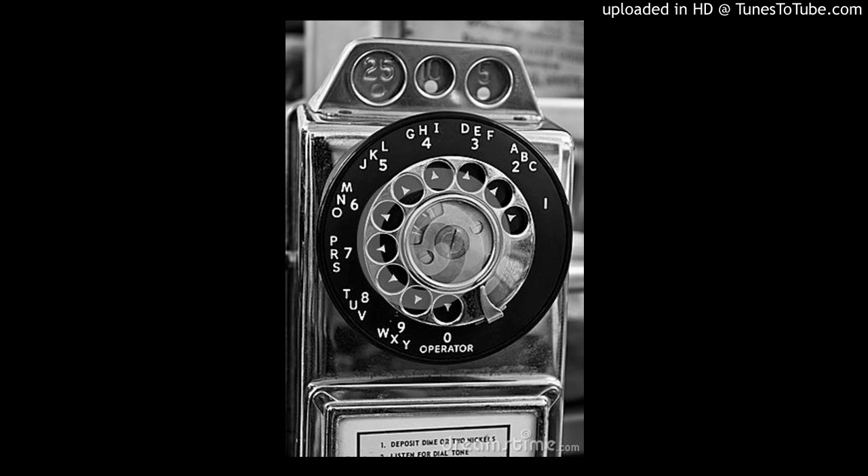The next four digits are dialed pretty quickly, so you don't hear the revertive pulsing. But after the last digit of the phone number, there's a ground test. At that point, the originating register sender finds out that there's no coin, and so it calls the marker again, requesting a reroute to the dial tone first intercept recording. The recording says: 'The call you have made requires a 10-cent deposit. Please hold on, wait for dial tone, deposit 10 cents, and dial your call again.'